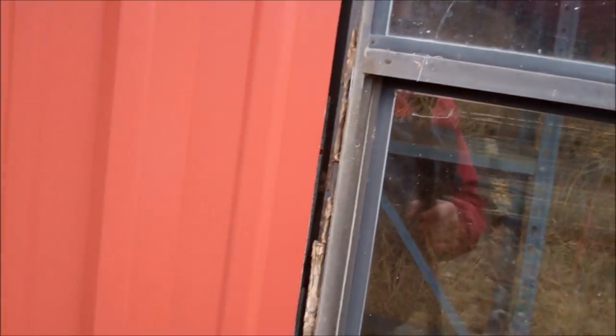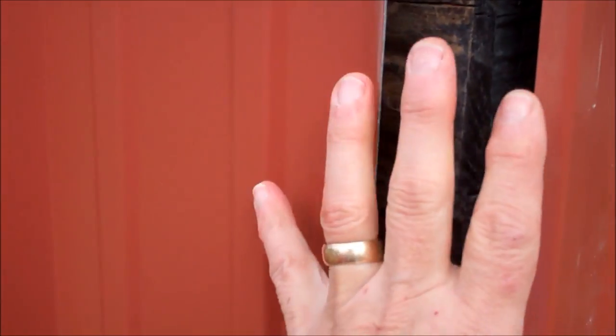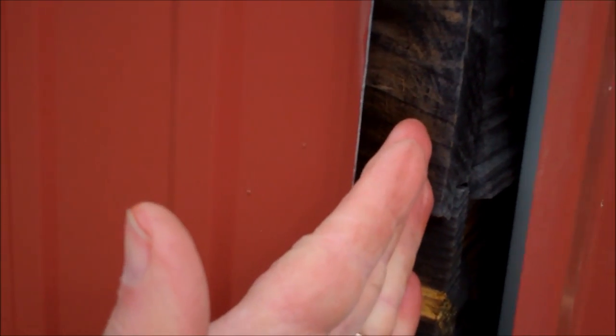That's about what brick is anyway. So by the time it's all said and done with the trim and all that, I think that particular window is going to work out perfectly. The corner trim will cover all that mess on the corner. That's why you don't worry so much about corners — get it close, as close as you can, and then the trim takes care of the rest.